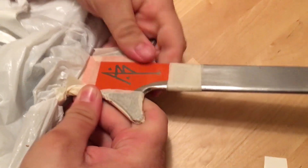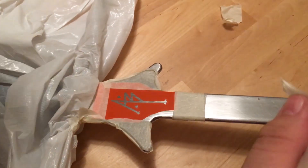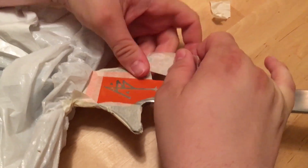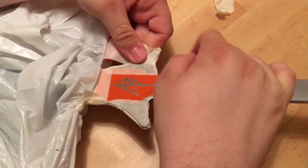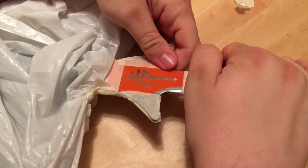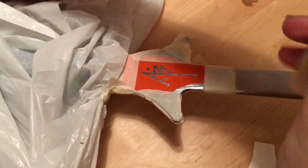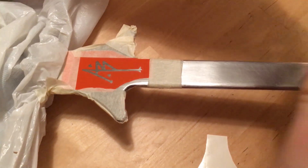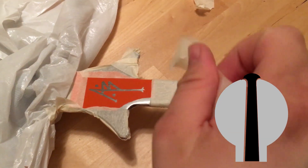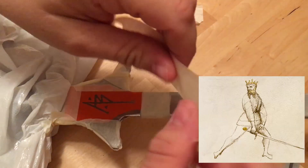The nice thing is I'm not doing a bath with this, which is really messy — much more acid on your hands when you're done — and it would be almost impossible to avoid getting the rest of the blade or the hilt into the acid. The reason you don't want that is that the acid eats away a little bit at everything it contacts. Because there are really tight tolerances inside the hilt, it would make your hilt rattly. And if there are places where something's peened, it could make it weak enough that it could fall off — and you don't want your peen to fall off.